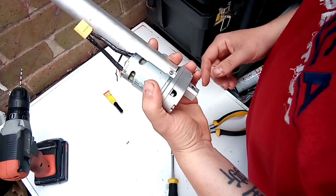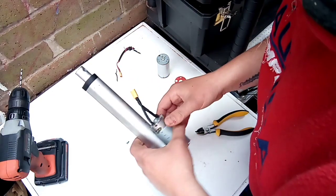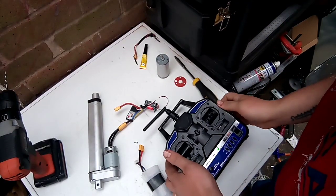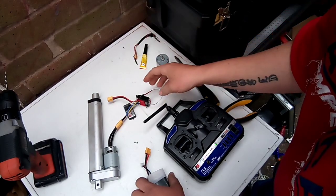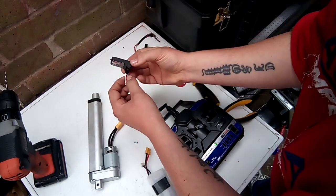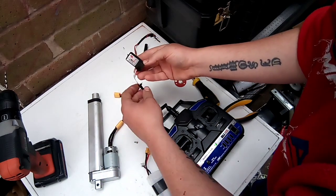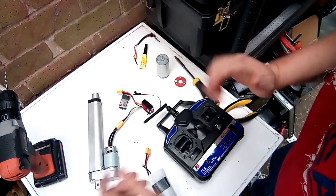So the thing now is to get a battery, speed controller, and test this silly thing — make sure I've actually done it right. I've found a very old transmitter, battery, and the speed controller I was doing the other week. As I've pointed out regarding the red wire in the BEC — a lot of people cut it off — because I've saved it, I've been able to reuse it to now power this or other applications.